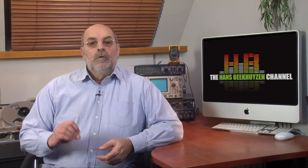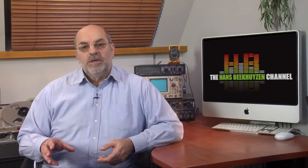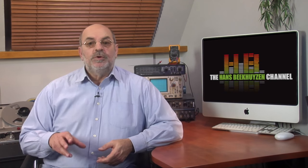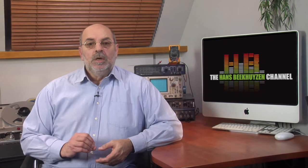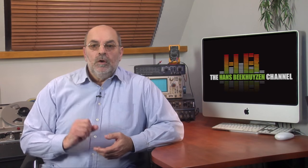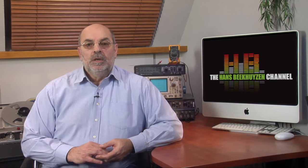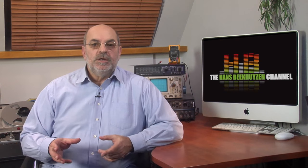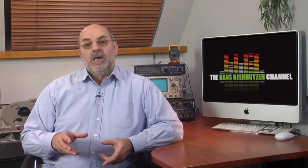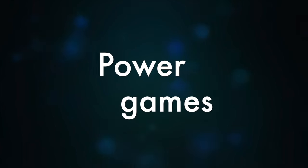The third trial was done in my set 2 using a Raspberry Pi with a HiFiBerry Digi Plus interface and the S-Booster Best of Two Worlds power supply connected directly to the Digi Plus board. See the link in the top right corner for a description of the Digi Plus and the Best of Two Worlds combination. Here the Jitterbug gave no improvement, which isn't a surprise since the Digi Plus was powered directly from the clean linear power supply, while the Jitterbug was further away on the Raspberry Pi USB power line.